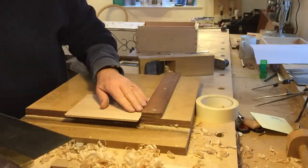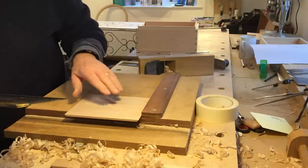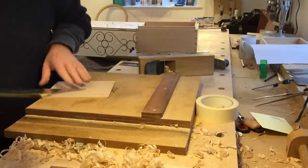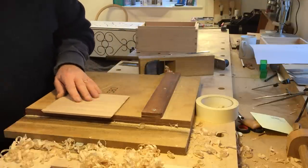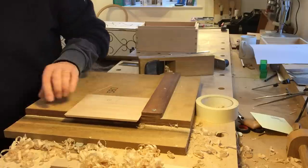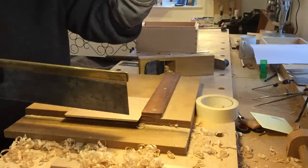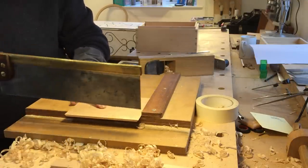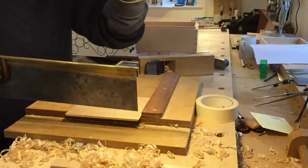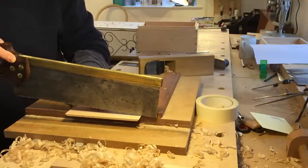Put your job just overhanging that stop there. This tool is a holding jig — put your job against the stop, hold it against it, just overhanging this edge here. You need a light so you can see: as the saw comes down it puts that line slightly into shadow, so you need the light. I'll put it over this way so that it's shining on the job.